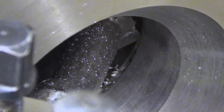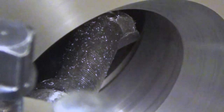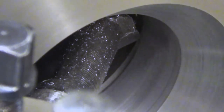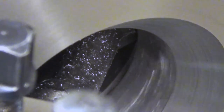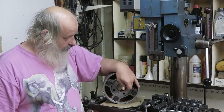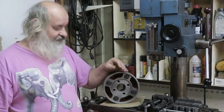I just now finish it, make a finish surface there. So last 0.1 millimeter like this, and then very, very gently. Sound when we are finished. There we are. Stop it. So now we have a good hole there for this center hole. It doesn't look bad when you look into there. It makes it easier to stick your stuff through.